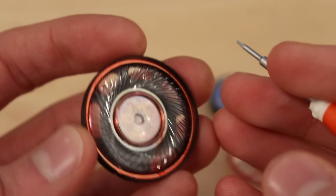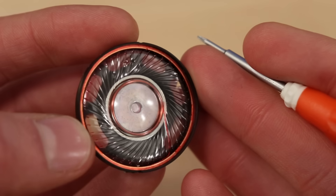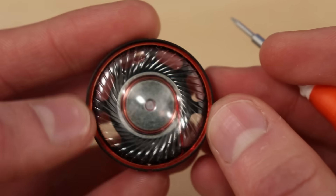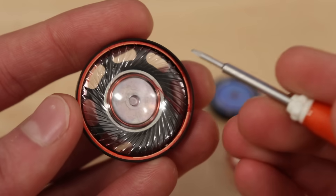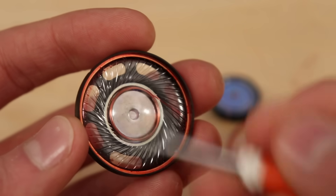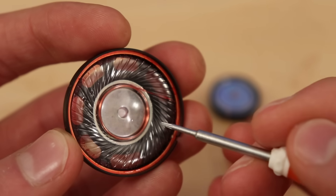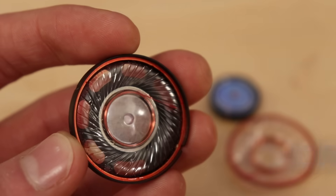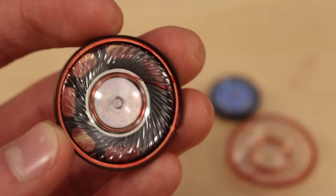I won't go into too much detail in this video because I don't want to overwhelm anyone. But for those of you who are geeky or inclined to find out more, this is a very similar technology to what's used in loudspeakers, and if you check out some of the links in the description, you can find out precisely how and why these work. The differences between cheaper models and more expensive headphones really come down to the dimensions, the weight, and the materials chosen in this driver assembly. So you might have a plastic diaphragm material or some special precision woven fabric. If you've got many more coils, you're going to have a higher impedance because there's more distance for the electrons to travel through that wire, which means more resistance or impedance in your system.